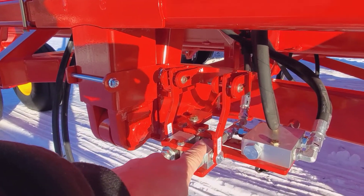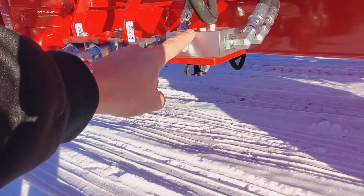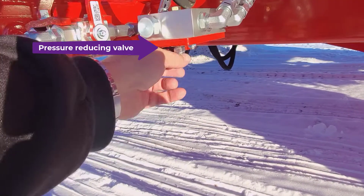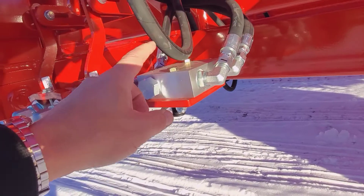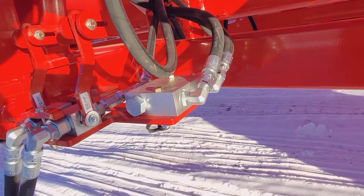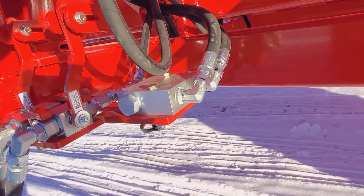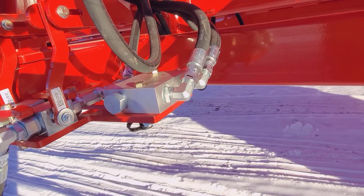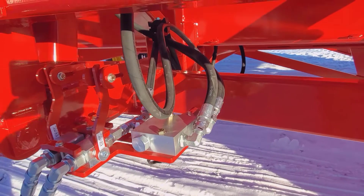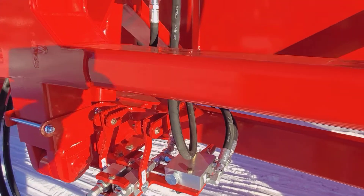But simultaneously, we can't simply shut off all the flow. We have to force that oil through a pressure reduction valve. There are test ports — one down on the bottom on the right side and one on the top on the left side — to test what the pressure is reduced to. It should be approximately 500 psi only on that cylinder, so that it won't damage any components or try to pick up the main frame with those two hydraulic cylinders.